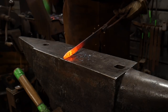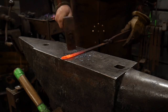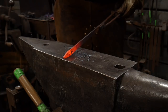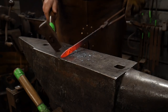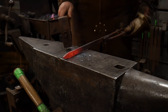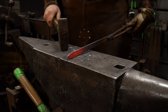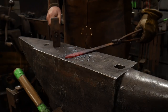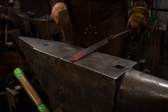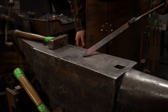We're going to start by putting a taper on the end of this bar. As you can see, this is a piece of flat stock — 3/16 by 3/4 inch flat stock, or in other words about 20 millimeter by 4.5 millimeter if you're looking for a conversion. You could get away with 4 mil and 20 mil. So that's it for that — we've got the first tip there.